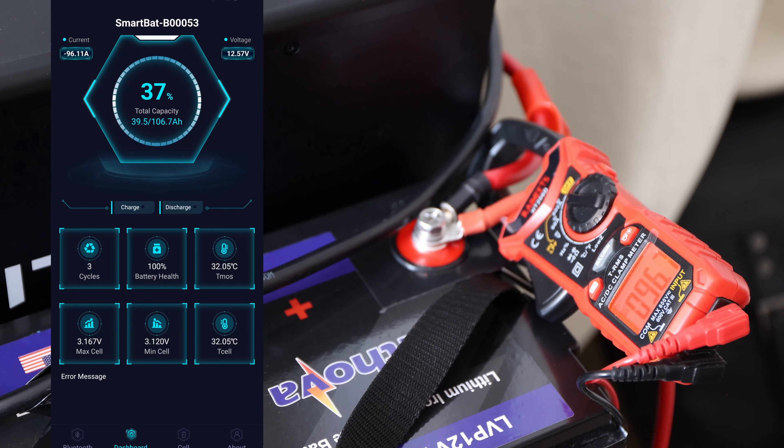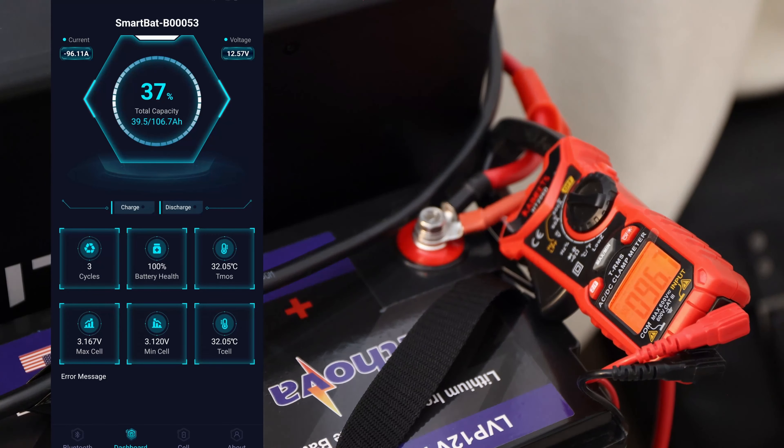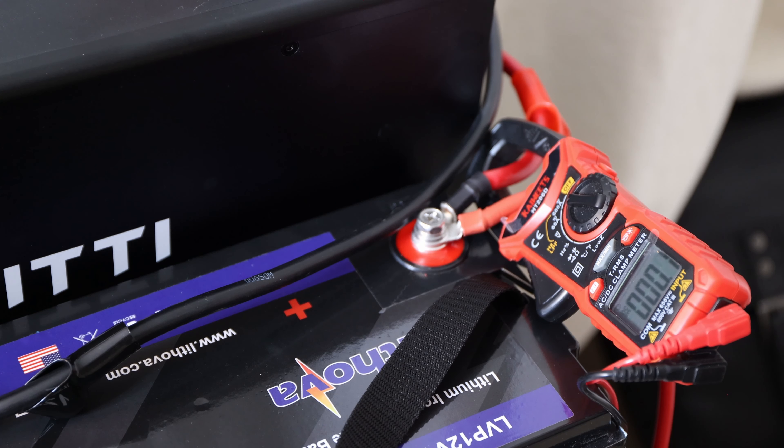It's getting warm here with the heat guns. Let's stop it there — awesome. The spec says peak discharge is 300 amps; we got it up to 200, so I'm pretty satisfied with that. Thanks for watching this teardown and capacity test. What do you think about the Lithova battery? Let me know in the comments below — would you use a battery at this price point with Bluetooth and high and low temp cutoffs but with these cell types? I'll keep going with this stuff — I love it. If you want to see more content like this, like the video and subscribe to the channel. More stuff to come. Thanks for watching!